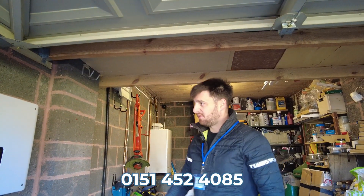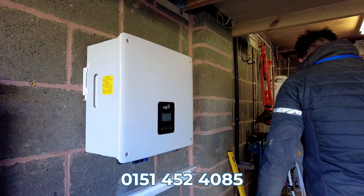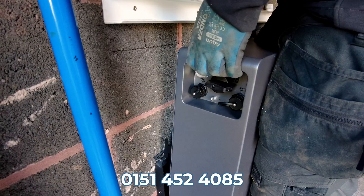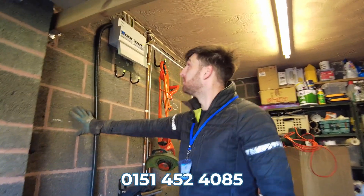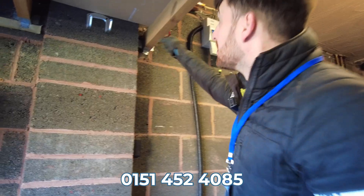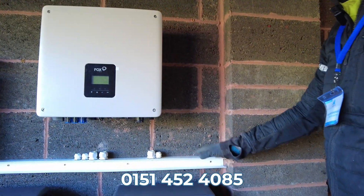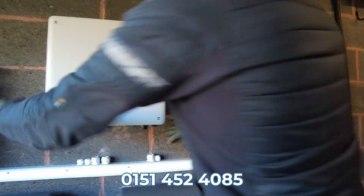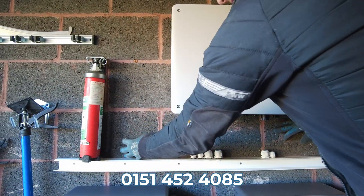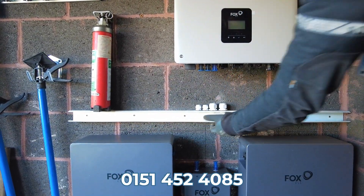We measured out and put in the 3.7 inverter, two EP5 batteries in the junction box, and some containment. Ready to start wiring it up. We're going to put a new subboard over this side, go up and over in conduit, back down here with an AC isolator and AC input. The DCs are going to come in here, DC isolator there, and the battery output is coming out the bottom of the containment.